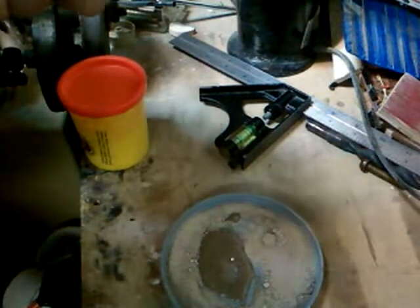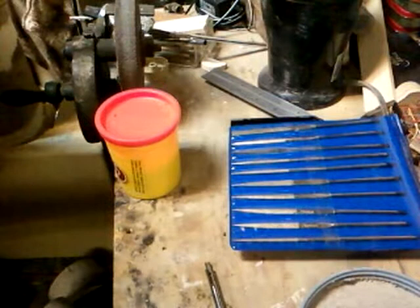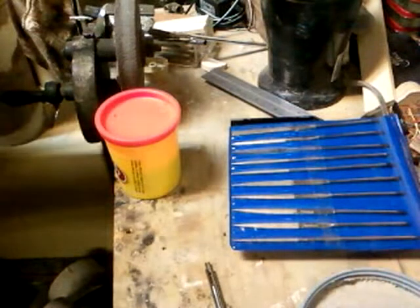I don't have a kiln to throw this into, but we've got a wood burner, so let's throw it in. I also tried hardening the handle bit off of the thread parts where it was all chowdered up — I just stuck it in the wood burner and heated it up to see if it would harden. Heated it up to orange hot and then quenched it. It was still soft, so we'll have to see how it goes with the sugar hardening.